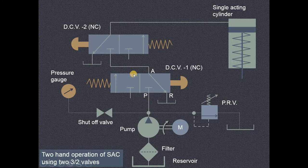This is a single acting cylinder — it is spring controlled. When the fluid is admitted on one side of the piston there will be compression of the spring, and then retraction will take place using this particular spring force. This is the pressure relief valve, which is used for relieving the liquid when the system pressure exceeds the design pressure. And this is the pressure gauge, which is used for indicating the pressure inside the circuit.